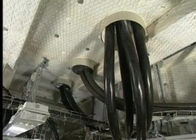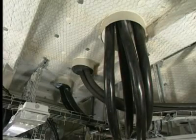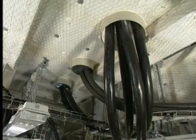In this first case, we will be sealing several large power cables vertically through a deck penetration. First, ensure that the surface of the penetration sleeve is dry and free from grease and dirt.